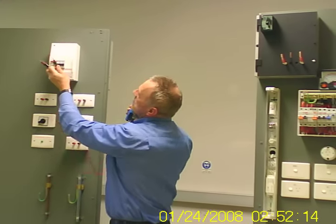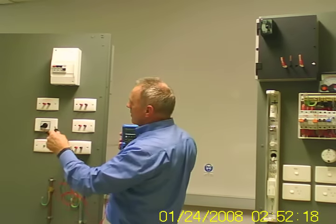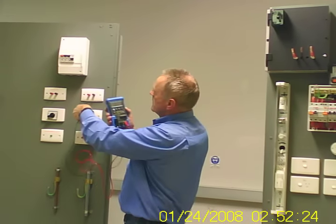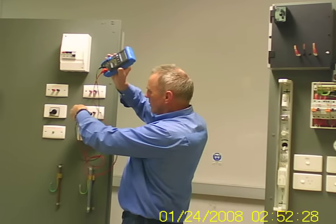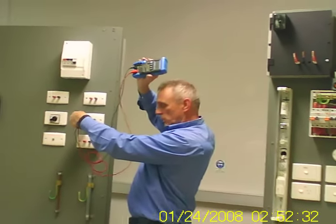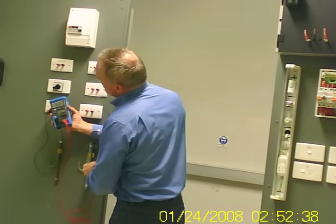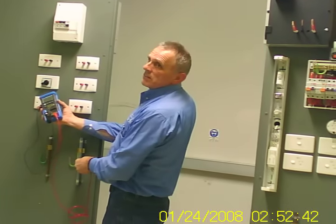Okay, look at this scenario. We put more load on, we put an oven on, and then we put, say, a hot water service on. Look what's going to happen here. We're down to 17 volts. Now, what is now reflected on the earthing system? Have a look. From the known earth, we should have the rest. 9 volts, yeah, about 9, 9.5.